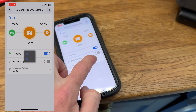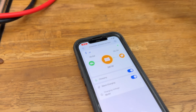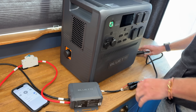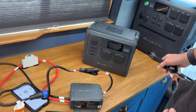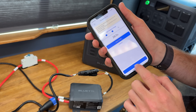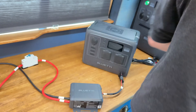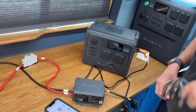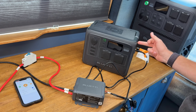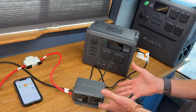Whilst it's running flat out, let's turn on silent charging and see what happens. Silent charging slowed the fan a little bit and slowed the actual charging potential. First test seems to work fine. Next up, Bluetti AC60 — I do have to change things for this one. Charge voltage, select the model, AC60, now set to a maximum of 28 volts. It's now set to the new voltage and asks me to wait 90 seconds. This unit is a maximum of 10 amps out, but the MPPT built into this is a maximum of 8 amps. So it's currently 28 volts times 8 amps, giving just about 200 watts.